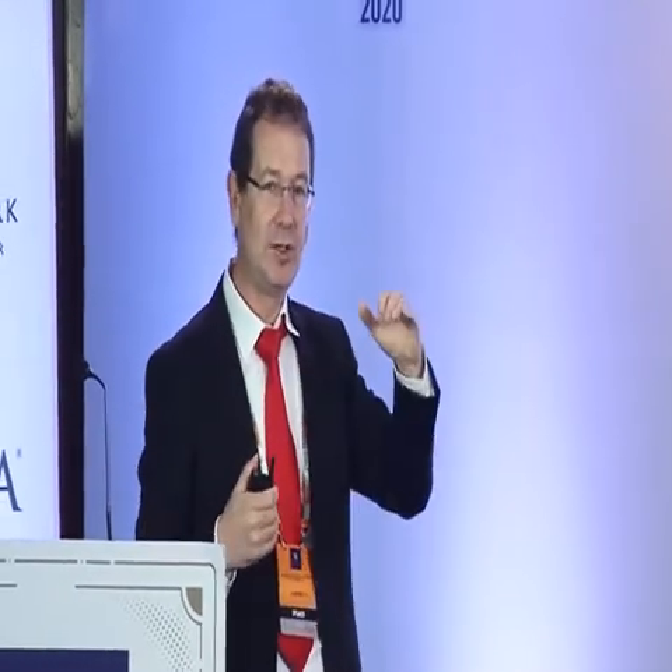Electropolishing can make a nice shining without rounding the prongs. You look with a very good loupe on the prongs and if there is any rounding, it is not accepted. We faced this matter often in the past and that's why we needed to come with a solution. In electropolishing, you get a nice shining and the prongs still have a good shape.